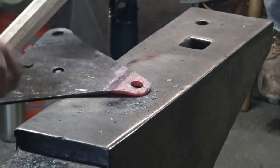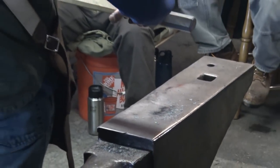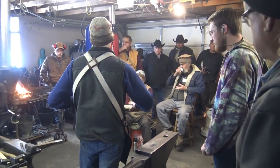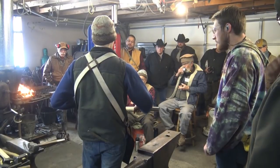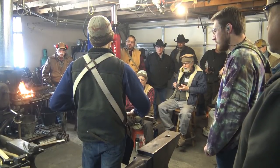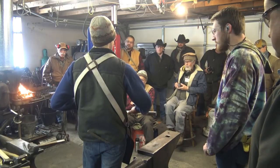The other thing I'm doing is I'll make a hit and then I'll overlap the fuller about halfway to just try to keep the line inside smooth. And when I'm making that first pass, it's a lot easier to feel this back edge of the fuller in the line I've already made and the front toe kind of on my cold chisel mark.